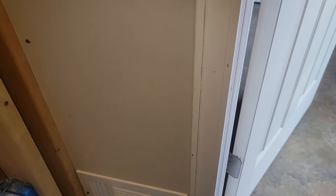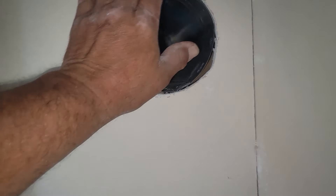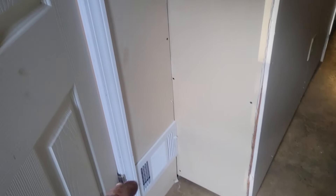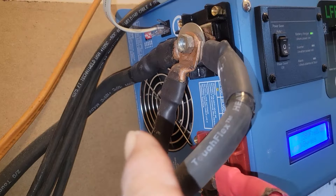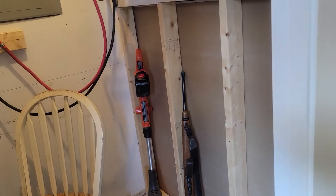That way it can pull fresh air through the wall. I added this pipe up here and came out the exterior of the wall, so I've got to figure out how I'm going to cover that with some kind of grill to make it look better. But that blows the heat from the inverter out of that room and allows it to suck the cooler air from the floor into the room. This thing has fans built in to pull air in on one side, so it'll help pull air across the room, up and back out, so it can stay cool and I don't have to have this door open.